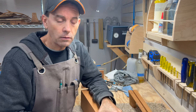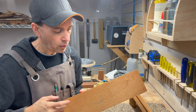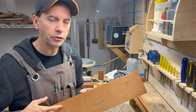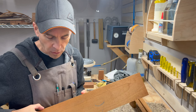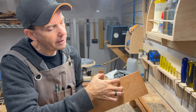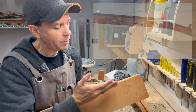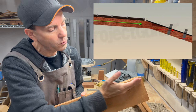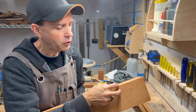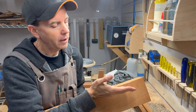Now, when we talk about a one-piece neck, we're talking about cutting it out of a block just like this, all with one pass of a cut. The challenge is that this is where we introduce short grain. You have long grain running through what would be the main portion of the neck here, and as you make the cut into the headstock down this direction, now you've introduced short grain because the grain of the wood continues to run out in this direction.